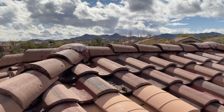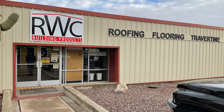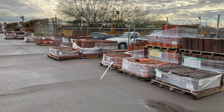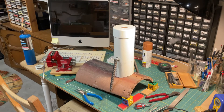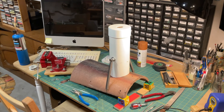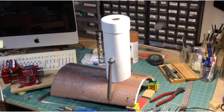In order to figure out how I was going to mount this antenna to my roof, I visited my local roofing supplier and found a tile that was a close match to the one lining the top of my roof line. Purchasing this tile made it easier to design a solution in my shop rather than having to climb up onto my roof. The design involves using the tile to estimate the taper on a 4-inch diameter piece of PVC, then using a razor saw and a file to finish off the pipe so that it seats nicely on the tile.